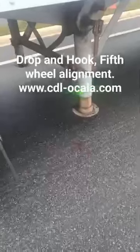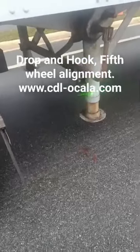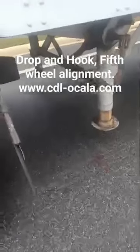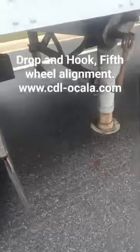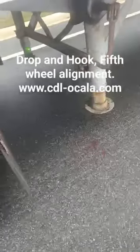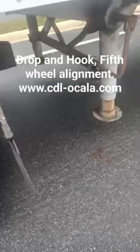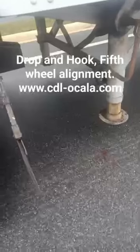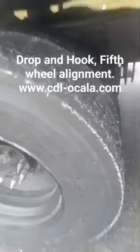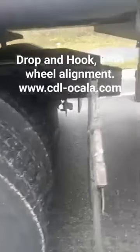Reason being that these legs, like I told you, it could be a brand new trailer. I've seen it when I was working at FedEx. A brand new trailer, with less than 500 miles on it. The guy was cranking the wheel down. This leg went down and that one didn't. When he pulled forward, he was an experienced driver, so he saw the trailer move in the mirror. He caught it right here on the frame. See? My trailer slips and falls.